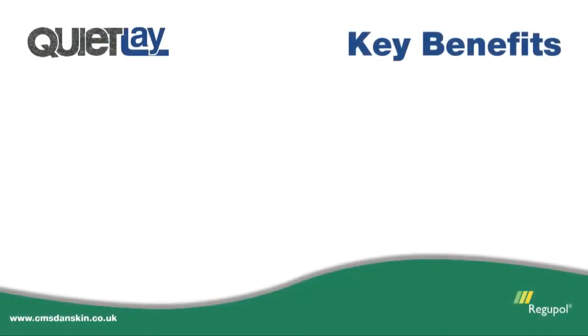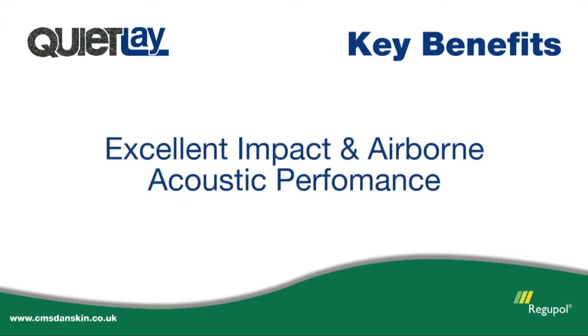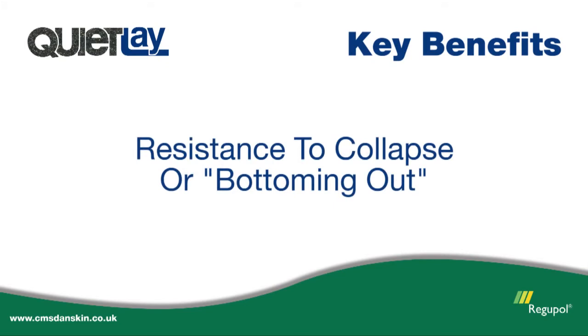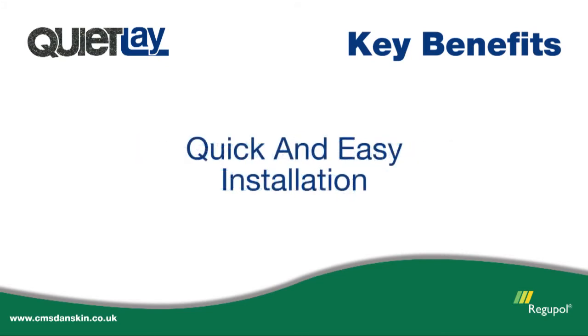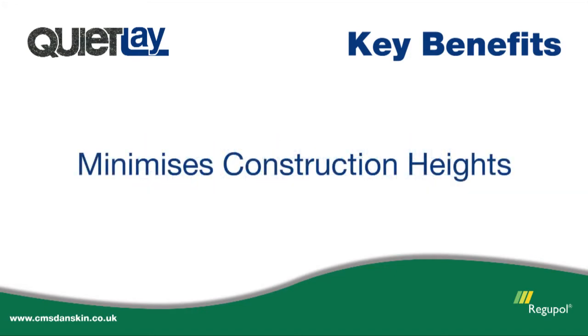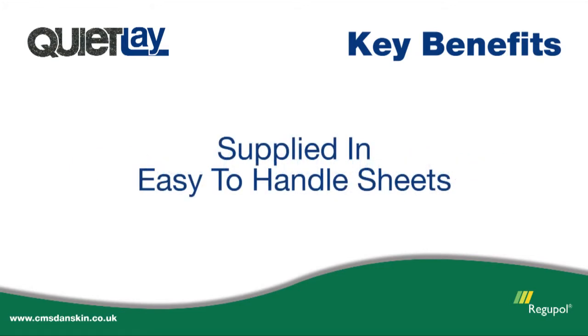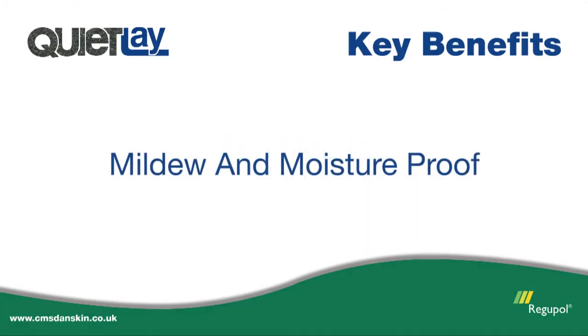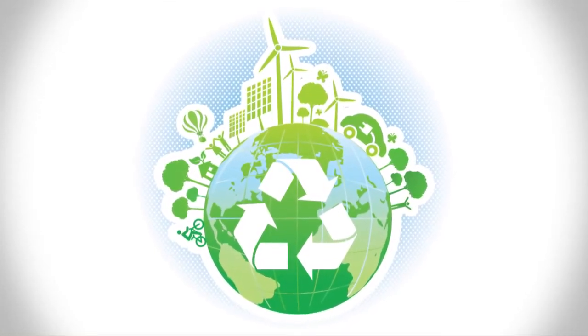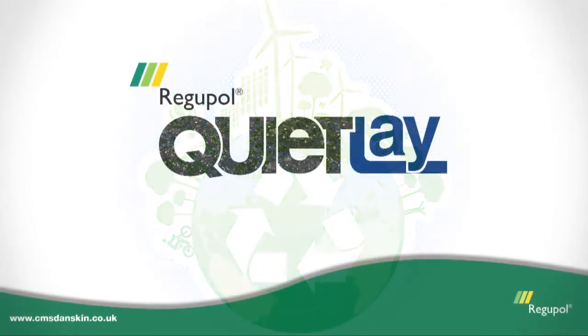The key benefits of using Regupol Quietlay are excellent impact and airborne acoustic performance, design flexibility, long-term performance without collapse or bottoming out under high point loads, quick and easy installation with no need for separate perimeter strips. When used with a sand and cement screed, there's no requirement to use a DPM. It minimizes construction heights, is supplied in easy-to-handle sheets, and is mildew and moisture-proof. Quietlay also offers zero global warming potential and zero ozone depletion potential.